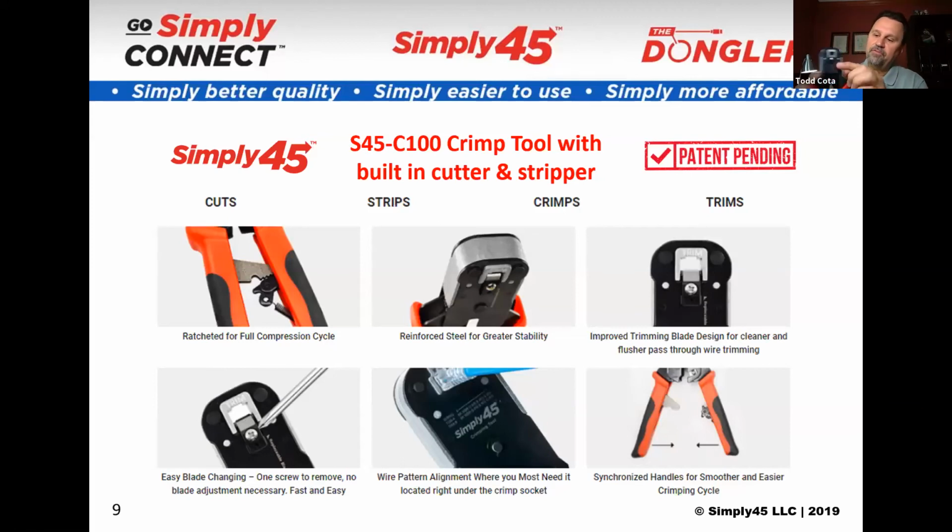Another thing we're proud of is our blade design. It's not just a blade held on by a screw, it's an actual cartridge. I mean, it's very robust. So what that does is it prevents it from flexing. When this thing is going through the process of crimping and cutting, the blades can flex and pull and stretch those conductors on the front inside the connector, and that changes the impedance of the cable as well. So what this does, it's at a preset. There's no calibration. It's another plug and play design.